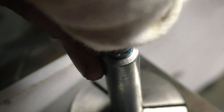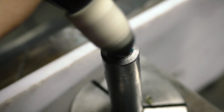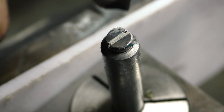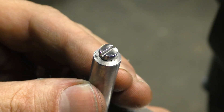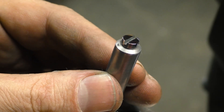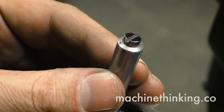Polishing the top is very similar to doing the sides. With the screw on a stick still in the collet chuck, I can hold it steady and polish the screw head. We're aiming here for something clock and watchmakers call black polish — that is to say, the polish is so high and flat that you can see the reflection of a light source well, but when it's turned away it suddenly is nearly black. After a few passes with the diamond polish, I think we're there. Not absolutely perfect, but for something which can be done in a few minutes, I'm very pleased. I'll see you next time.